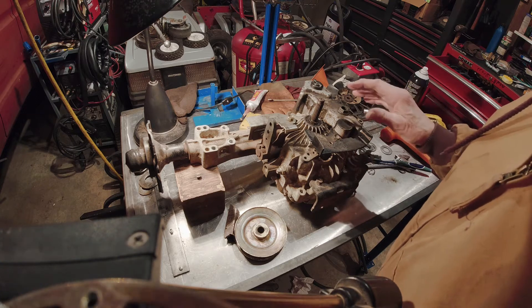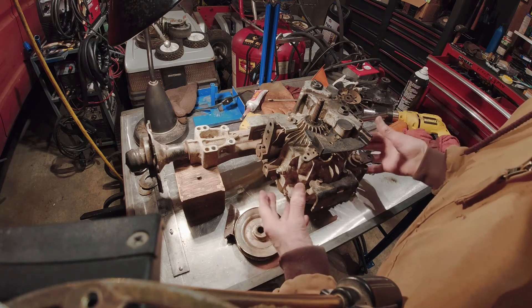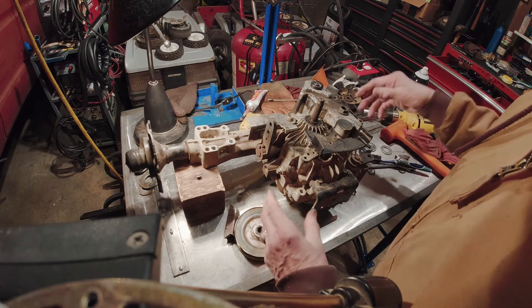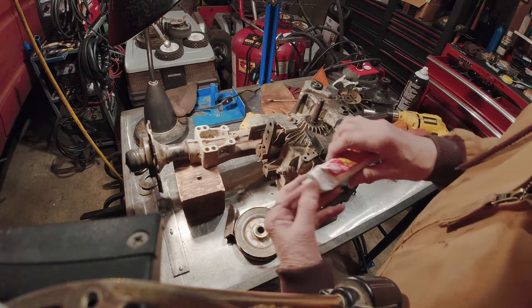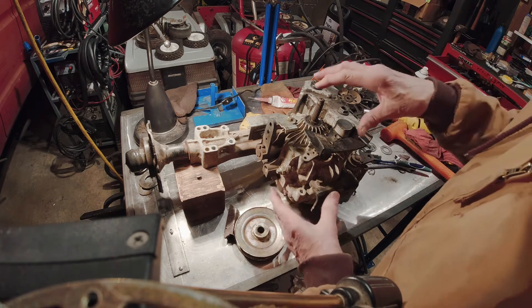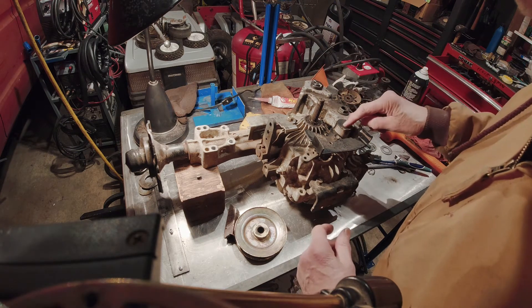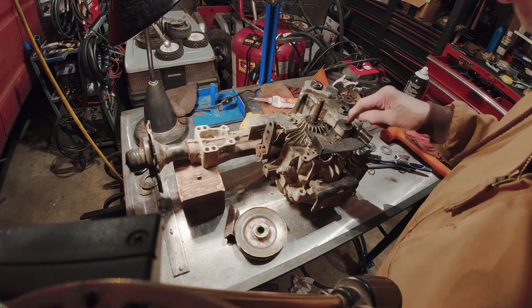In part one, the transaxle was inverted, the sump cover was off, I showed how to remove the axle, put in a new one. I obviously have done that. I put RTV red silicon gasket on the sump cover, let it set up for a few minutes, put it on, bolted it on. I removed — this is the vent plug, this is the fill plug — both these plugs were removed. But removing the fill plug: